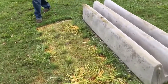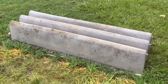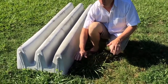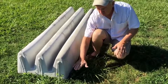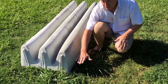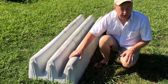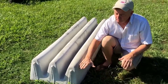You can later take your tractor and pick these up. You can either dig down and set them in the ground — if you do that, keep them elevated above ground level at least four inches and slope your fill around it. Or if you want to leave them on top of the ground, make sure it's a level surface, put them all together, and then take your fill — gravel or dirt — and slope it away.